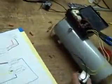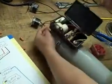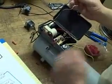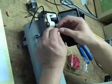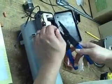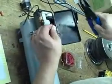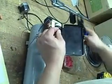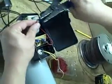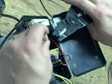But let's look. That's going to be water pump number one, which is going to sit in the reservoir at about this height. So as far as the amount that comes out, this much is just fine, whatever is easy to work with. So actually, what we should probably do is take these wires and start making it so we've got good terminals to work with. Now, you can see on here, I'm kind of choosing the top one. And when I do that, I grab about that much wire to work with. You can see it's maybe a quarter of an inch, just something so you have enough to get a good terminal lead.